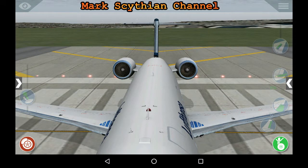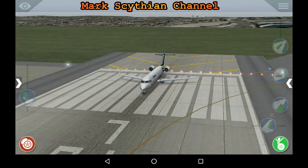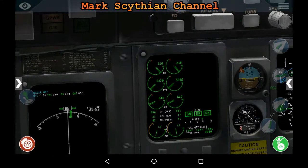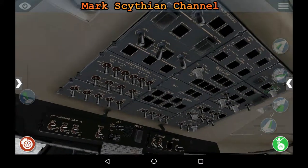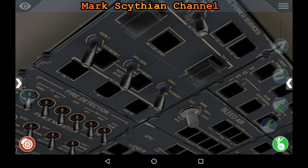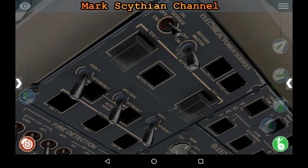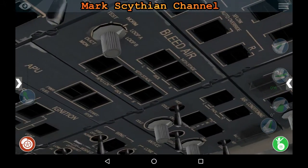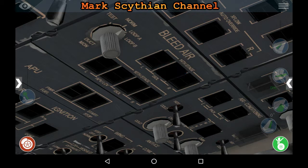Take a peek at that right engine's fan — N1 is spooling up. Now that we have both power plants lit, their onboard generators can be accessed through the two generator switches. Now we can go ahead and disengage our APU generator — or I'm sorry, APU interface circuit. We've shut down the battery. We've got power from the engines.